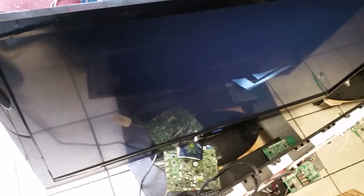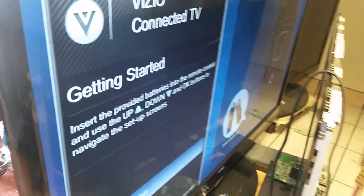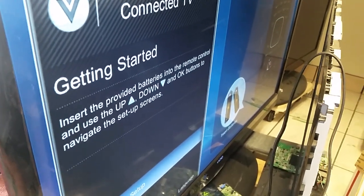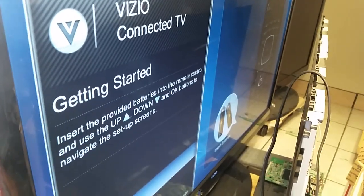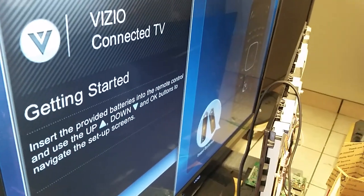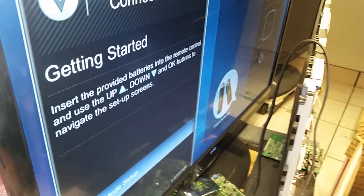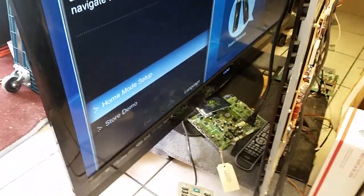The visual comes up. On these boards, like on all other boards, the EEPROMs are not the only thing that may fail — the main processor may fail, the HDMI chip, the HDMI selector IC, and a bunch of other things. When the EEPROM fails, usually what happens is a very slow image showing up on the screen and no responsiveness. It's like a home computer spending 99% of its power somewhere else — you press a button and it takes seconds to a minute for the TV to respond. That is a good sign of a failed main EEPROM.